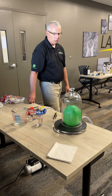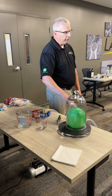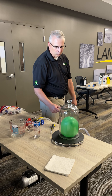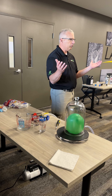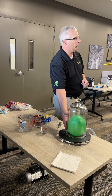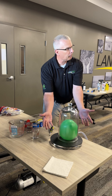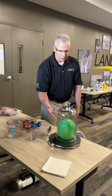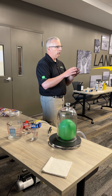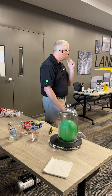There's less pressure outside while you remove it. The pressure was in there and you created a vacuum, so it had room to expand. The air inside the balloon is a fluid — just like refrigerant. Fluid always wants to move from higher pressure to lower pressure. So that air in the balloon is trying to occupy the space around the balloon because it's at lower pressure. And because the balloon is a flexible seal, it flexed to try to move into that space.